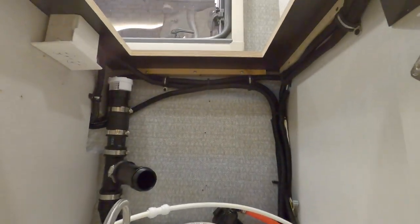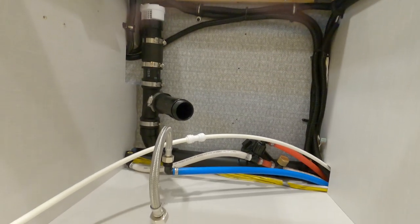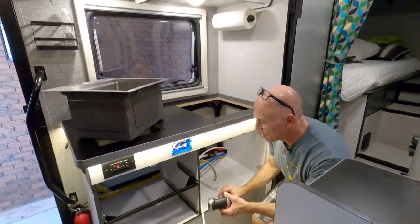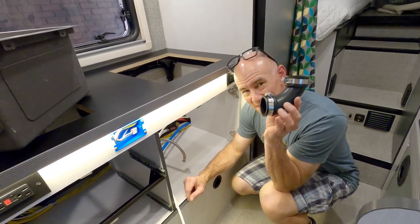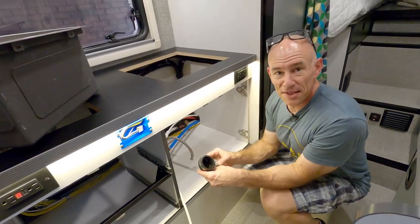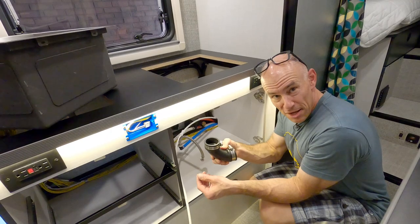Now, drain stuff. I've mentioned before that plumbing, excuse me, is my nemesis. And so cut the plumbing, and to rebuild it, I used a bunch of these. This is a Fernco plumbing fitting. Now, these are stupid expensive. This thing is like $9 right here. So for building something new in mass, I would absolutely not use these. I'd use the 30-cent ABS fitting.